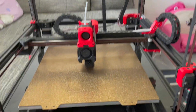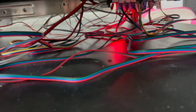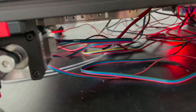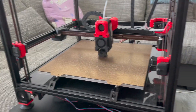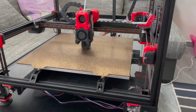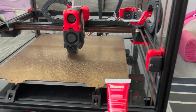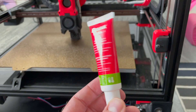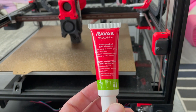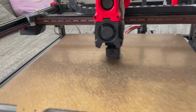So the build is complete - I still have a lot of wire management to do. When I finally got the quad gantry leveling working I got all the belts tensioned. I went and put some PTFE lube because I couldn't find white lithium grease, so I put that on all the rails. It's running really smooth as you can see.